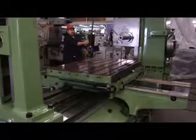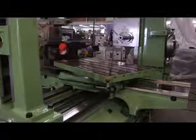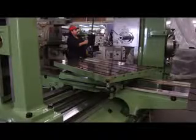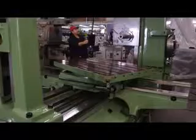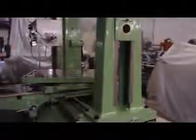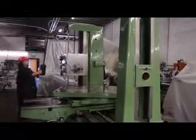Here's the power rotation. This machine has coolant, it has pendant control, it has auto lube, it has power rapid traverse, it has a facing head with the parking bracket. It's a very heavy pattern machine. Its motor horsepower is 12.5 horse. It's currently running at 440 volts. The tailstock is going up with the spindle. The overall weight on this machine is 24,000 pounds.